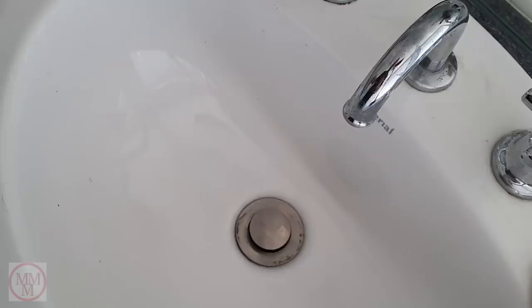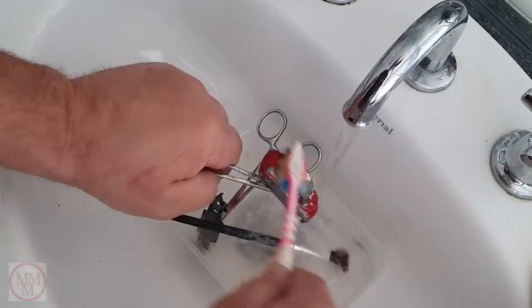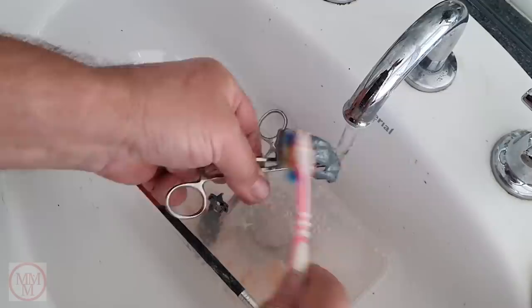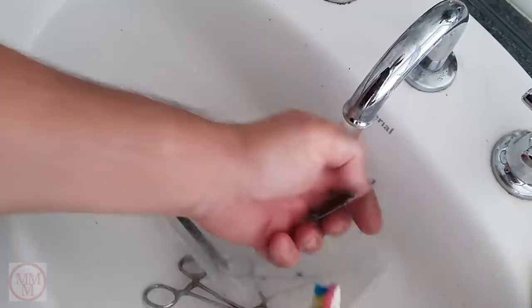So this is about an hour later and this paint finally has been dissolved by the paint stripper. And now you can see it's coming off quite well. Definitely not as easy as normal. As I say, it's probably older paint. Who knows? Could have a high lead content. Should really get one of those kits to test this, just for my own curiosity. I haven't got round to it yet. One day. And there's the base, paint-free at last.